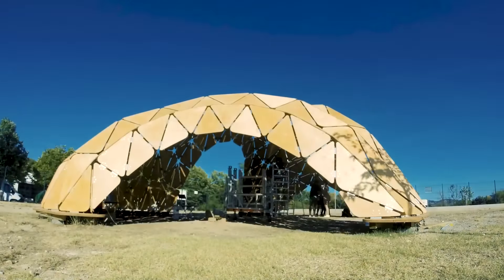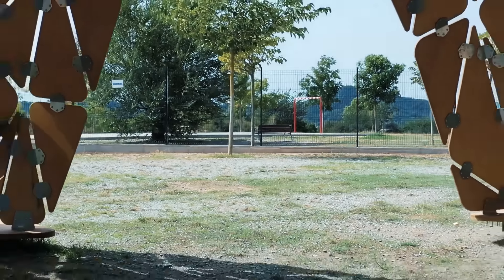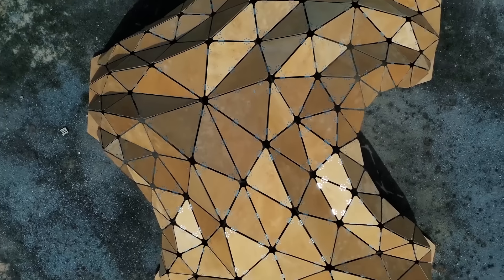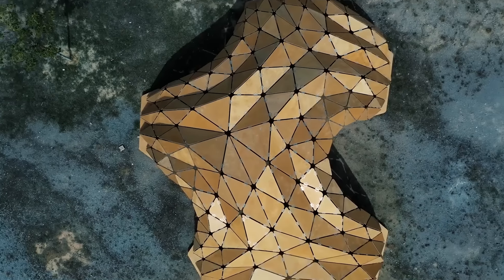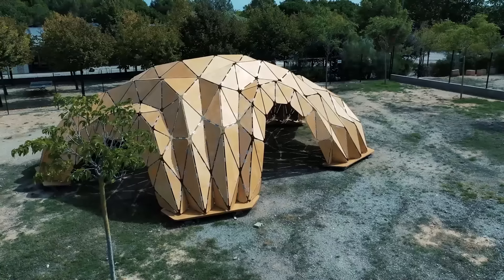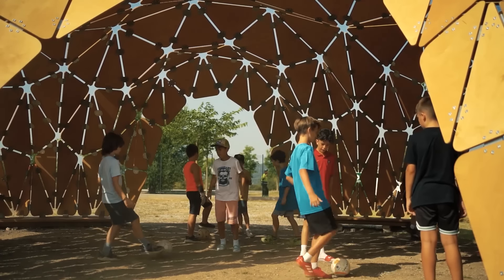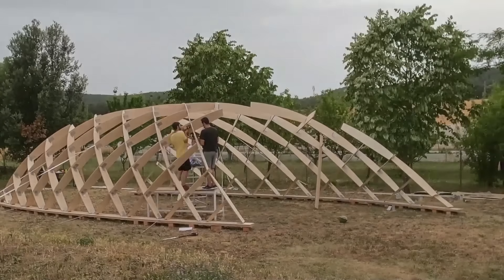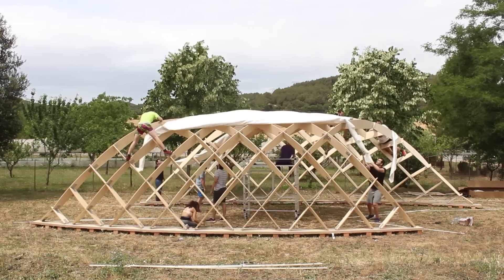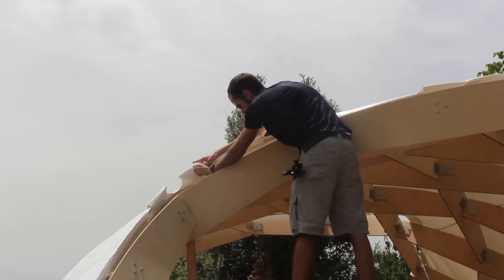It's inspired by the Zollinger system, transferring loads in short beams, enabling covering curved surfaces without long beams or complex joints, reducing cost, time and weight. The challenge lies in designing a joint sturdy enough to eliminate additional bracing. The entire system is compact and made with standard CNC and laser machinery. Students from the MPDA Master in Parametric Design in Architecture received continuous reviews from international experts, tackling design, structural modelling, analysis, fabrication and construction.